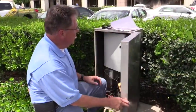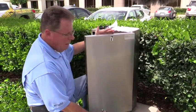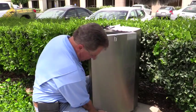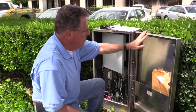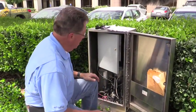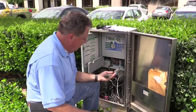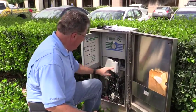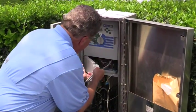So here we are at a controller over in Corona. This clock is inside of a strong box, and when we approached the unit, we found the controller to be unlocked — the door was wide open. Inside the host is a Hunter ICC controller that also was unlocked. When we opened the clock, we can see that someone has added some field remote cable, which is preventing the door from closing.